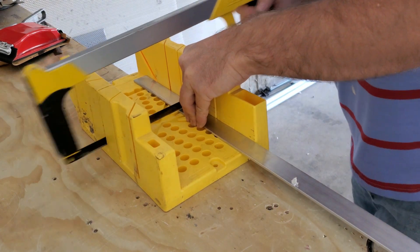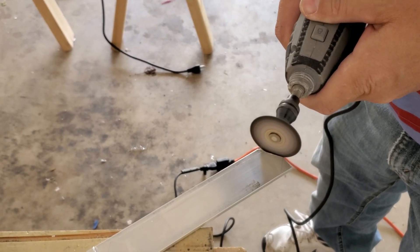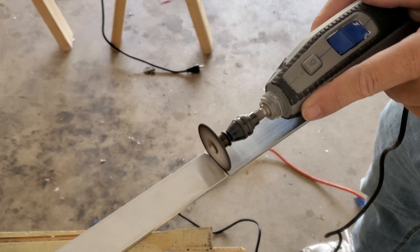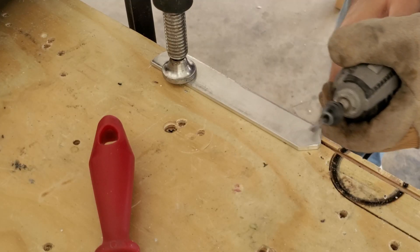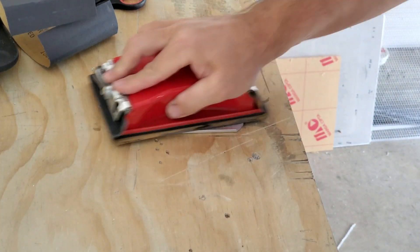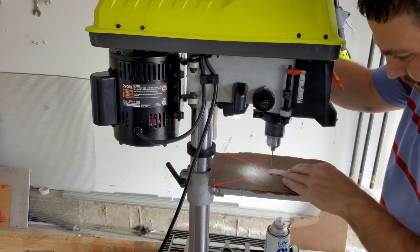The first piece to fabricate was the M.2 heat spreader. I got to work cutting a piece of one inch aluminum bar to size, but it only took seconds to realize my last hacksaw blade was dull as a butter knife. So on to plan B and out came the Dremel. The Dremel worked well, but that aluminum gets hot, and it took a lot more filing to get those edges smooth and even. Then using the Dremel again, I beveled the bottom edge of the part. Once the piece was shaped, I finished it starting with 400 grit and working up to 3000, then giving it a brushed texture with 320 grit. Finally, I drilled out the mounting holes.